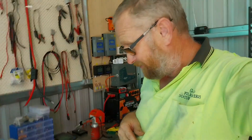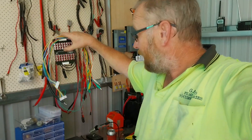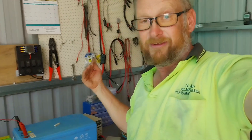What I'm going to do with this battery is cut it open, do a voltage test across each cell to see which cell is triggering the high disconnect — which will probably be the best cell. Then I'll put it on my active balancer to get the cells back in balance, do a capacity test, and hopefully recover some of the capacity we're missing. Then that'll be battery two done, and I'll do the same for battery three.